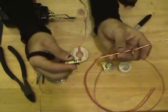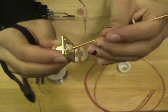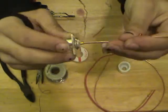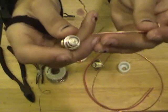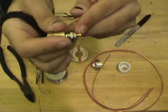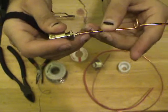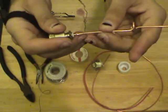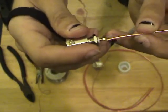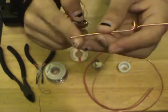I've noticed that when it comes to this connector, there's a problem. With the panel mount, this actually fits in nicely — the actual diameter fits in and it pushes in. With this bulkhead connector, however, it has a thinner diameter solder cup, so it's going to be soldered but it's not going to push in. So measure this and make sure that the final length after you solder it isn't off. With the previous one, it pushed in all the way to the bottom, but for this one it's going to be resting on the top — so it's actually going to throw this off about three millimeters. I have to cut this down about three millimeters.